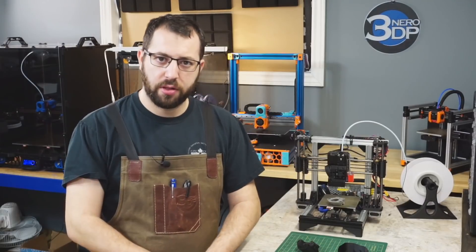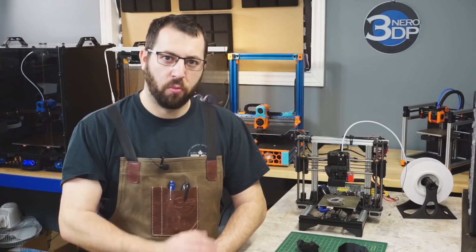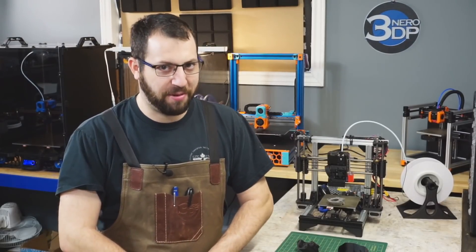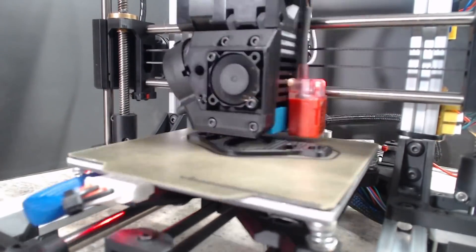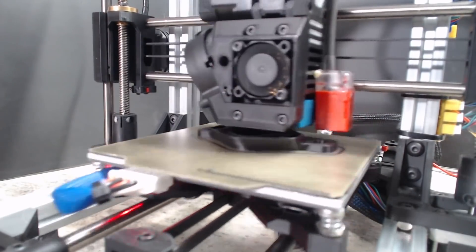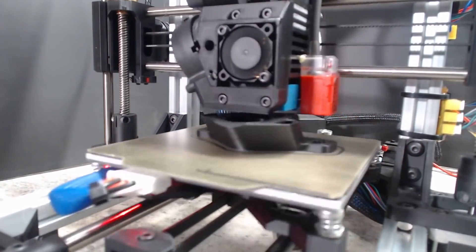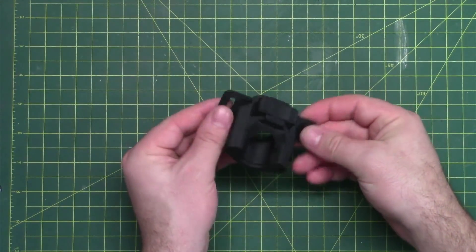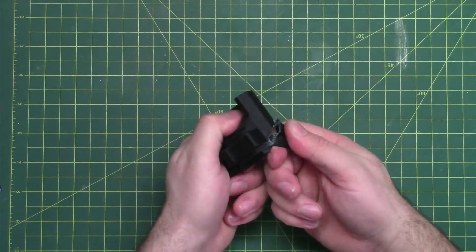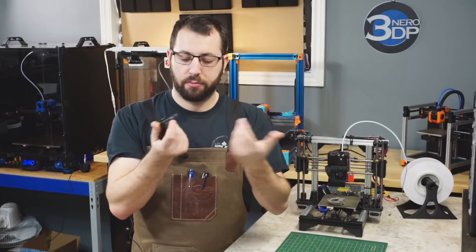I did print it with several different slicer options enabled: no brim, with brim, draft shield enabled, and enclosed. And as you saw in the beginning of the video, I also printed it with some really bad ABS that I've had kicking around for three years — the cheapest stuff I could buy at the time. So please don't buy the cheapest ABS. Now, the first piece I printed was unenclosed in a room with the doors closed, with no brim or draft shield. This print printed quite well, actually. eSun ABS+ is cheating when it comes to ABS. As long as you really don't have any drafts and you have good first layer adhesion, odds are you'll probably have a successful print. However, with it being unenclosed, it is subject to room temperature ambient temps, especially on a printer with a moving bed. While it printed successfully, layer adhesion — especially where the tabs meet the body — was quite poor and they snapped off relatively easily with basic force of bending by hand.